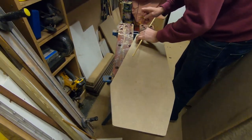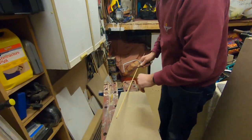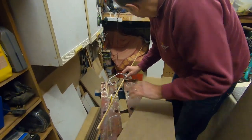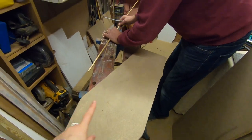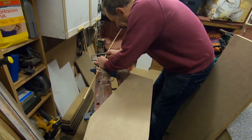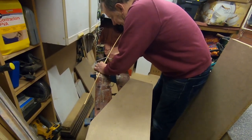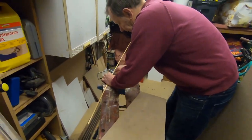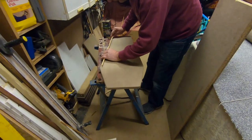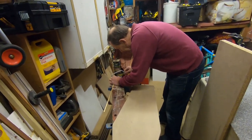So we've got the first one done. For this I'm just using a little hand saw — I don't mind things like that. It's just cutting it to size because the beading has got to go all the way around. Are you going to superglue it? Yeah, we're going to use a fast-setting glue so we can carry on — if I use PVA it's going to be a day's job, it takes like 24 hours to dry. I won't paint this until it's completely dry and sealed. If you don't seal it, the paint just keeps soaking up — as Ben was saying, if you don't put PVA on it'll just soak up the paint.